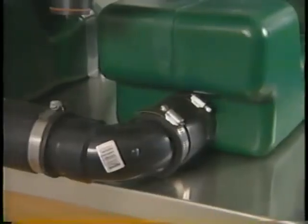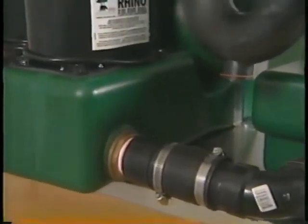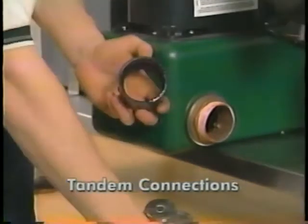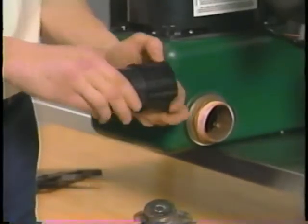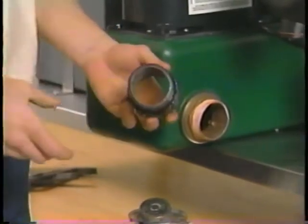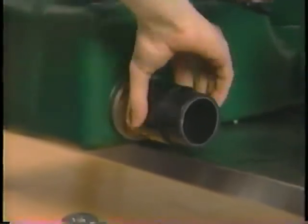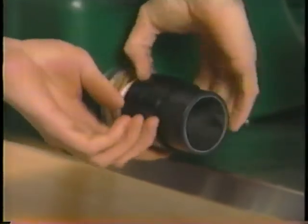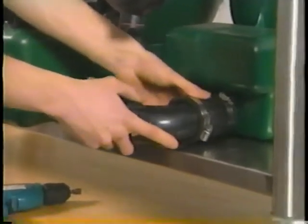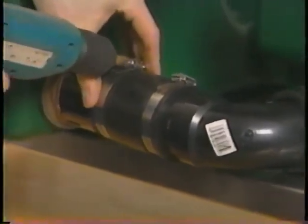Next, run the piping from the exit port of the gravity unit into the side of the pump reservoir. Glue an appropriate length of pipe into the connector to ensure proper spacing between the two Rhino units. Connect a threaded female connector to the bulkhead fitting after wrapping the threads with Teflon tape. Then use rubber MJ connectors and one ABS street 90-degree angle to finish all other connections.